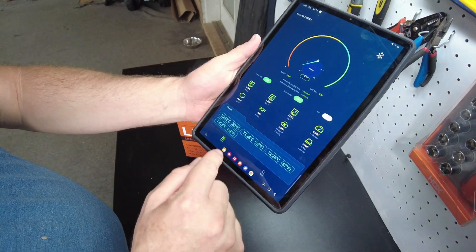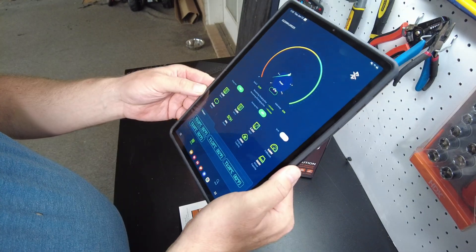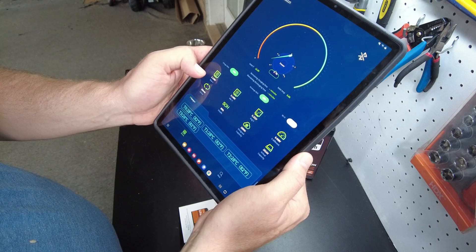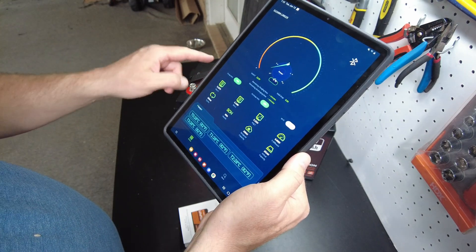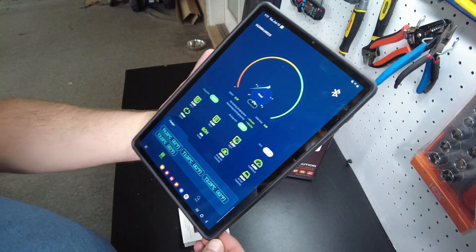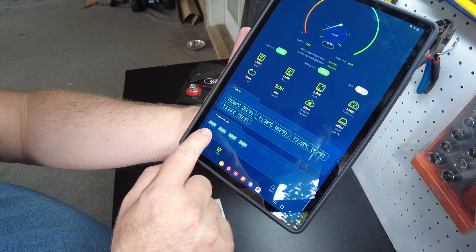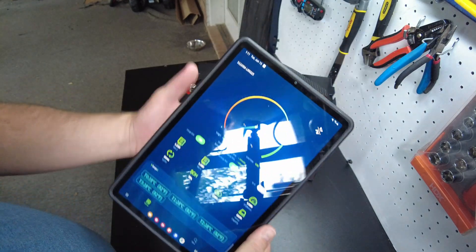Let's take a look at the app. Looks like we've got four temperature sensors — interesting. It's showing zero power, maybe it needs to be fully charged. The minimum cell voltage is 3.148, the maximum is 3.156, the average is 3.151, so this battery seems to be pretty low. Here are the individual cell voltages: 3.151, 3.149, 3.149, 3.157. Let's charge this thing up.